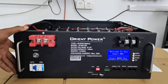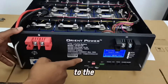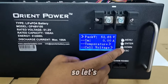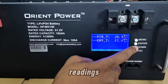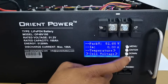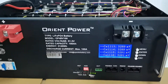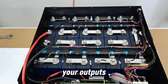The BMS is now running with no alarms. I can check the readings: all temperature sensors are showing valid temperature readings. Checking cell voltages, each individual cell voltage is displayed correctly. This confirms the wiring is correct and all connections are good.